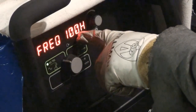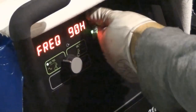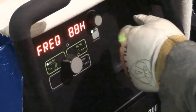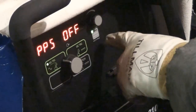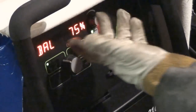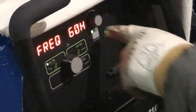I'm going to hit the menu here. There's my balance setting, and then there's the option for the frequency. Right now it's set at the standard factory setting of 100 Hz. I can go all the way down to 60 and all the way up to 150. I'll probably start off on 60 Hz and leave the pulses off. My balance will be set at 75 because I've pre-cleaned the material — that's a pro set feature on this machine.